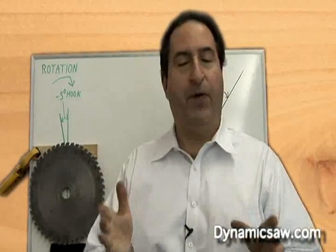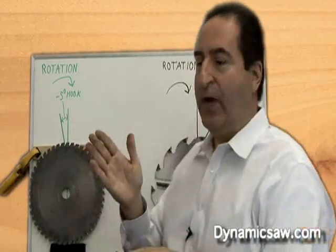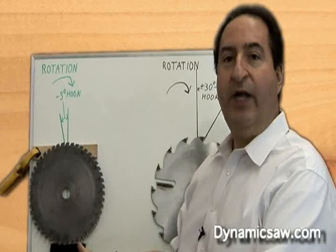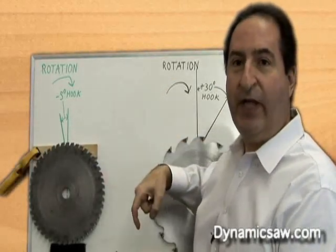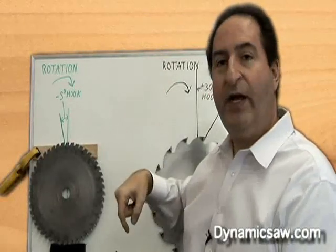The most popular chop saw right now is the DeWalt 12 inch compound miter. Have you ever done a miter cut and gotten fraying on the bottom and the back of your cut and couldn't figure out why? A blade from Home Depot that says it's made for this chop saw, or the blades that come on your chop saw, probably aren't a negative hook blade. If you envision a paper shear, it shears fibers downward — the knife starts at the top and shears down. A positive hook blade reaches in, grabs, and tears the fibers down, which is where you get fraying on the bottom and back side of your cut.